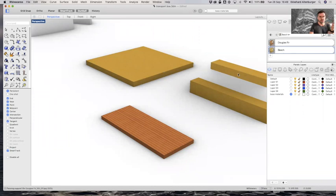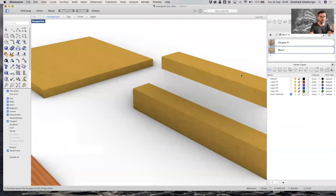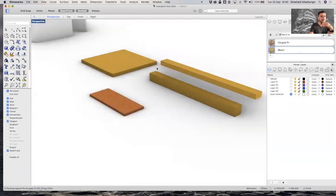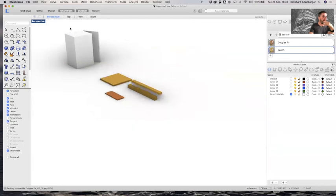These, you can actually use screws quite well. I don't want to encourage you to use nails, but screws is a good way to connect these things if you support it with glue. The biscuit joints always go with glue, the finger joints with glue as well. So I probably just biscuit joined a lot here.